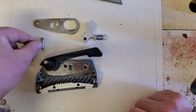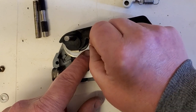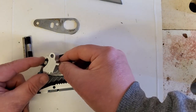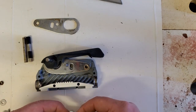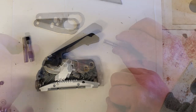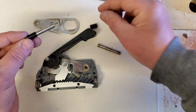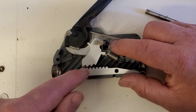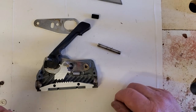With any luck the rest of the holes should line up. Next take a short stainless steel bar and that goes in the leftmost hole. Then take the jamming cam with the spring attached — that goes on to the first pin. This piece here has two little plastic shims on it, so take one of those off. The next one goes into the middle hole and the little plastic shim provides a load surface for the cam as it operates, so it's frictionless and you shouldn't get any rust or corrosion in there.